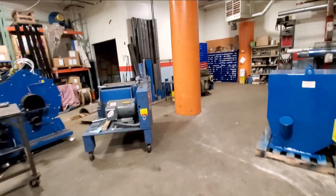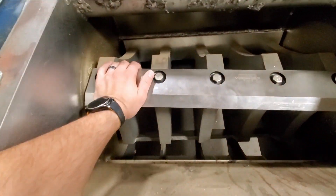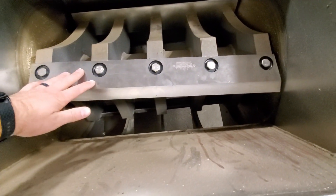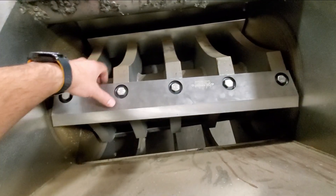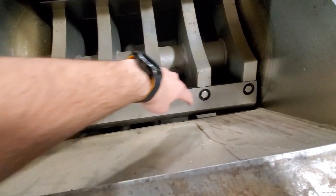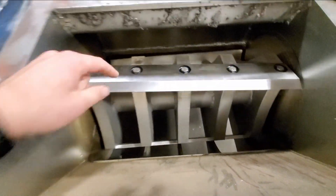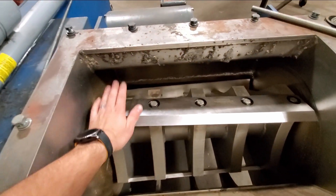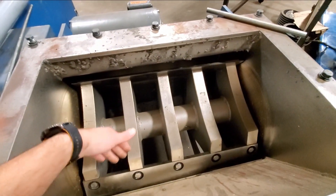Now for comparison, here's the other style of granulator — an older one we're refurbishing for a customer. This one has one blade going all the way across at a bit of an angle, so it's a scissor cut. They're still trying to achieve the same thing by concentrating pressure, but it doesn't achieve the same result. When it comes through and cuts, you have a lot more restriction than with just a single staggered-tooth approach. There are no screens in the bottom right now, but there will be, and the hopper is right there. Blade changes are a bit simpler — just sharpen the blades, a couple of bolts, and you're done. This style has three rotor blades and one bed blade, so blade changes are quicker, but you'll be changing blades more often.